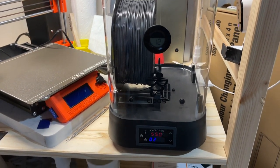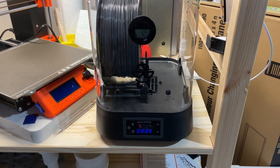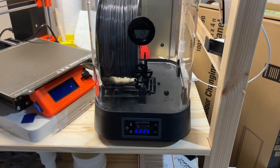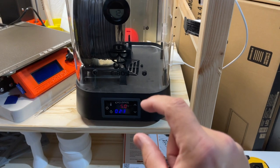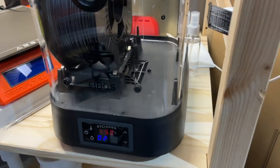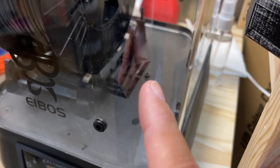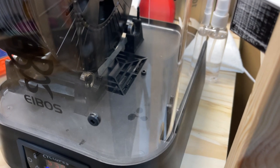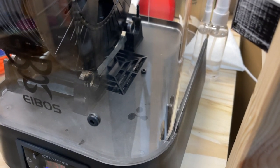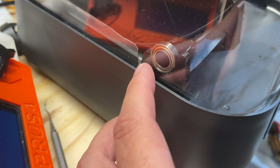This has been going for — I set it for six hours, about four and a half hours total. I checked it in between and it seems to be working better. So I did some modifications — I made a new one of those little shields. Tabs are cut lower, probably about three-eighths of an inch on the side. There's a little upright there. I went out a little bit further with the bendy tool and bent it up to give it some more support. Same thing on this side. It helps to lock it in between each of these little tabs so it can't move around.